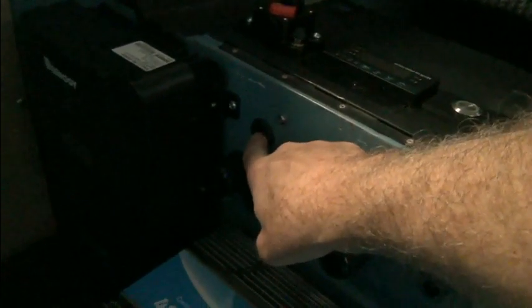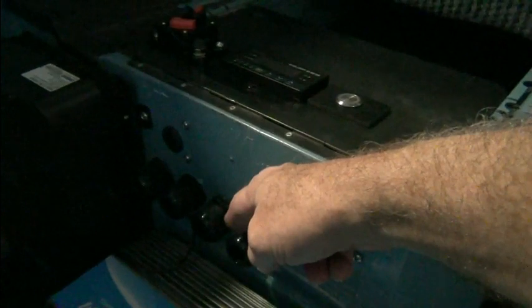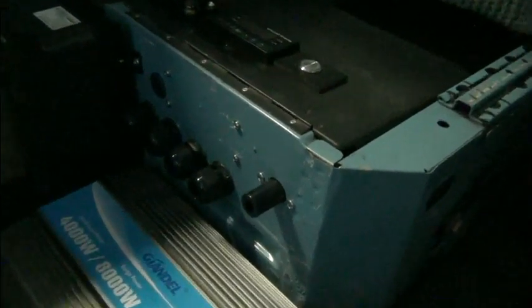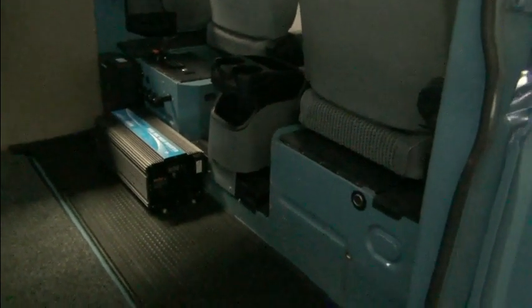So we're going to have some wiring go through here from the solar charge controller. This is going to be these 4 battery in, battery out. These will come from the 2 batteries, and this will come from our switch and our shunt and go down here to our inverter. So we'll show you that as soon as I get that hooked up. Can't show you the batteries at this point, but maybe later in this video, because we don't have them yet. We're still waiting on them. So that's what it's going to look like in the back of the car.